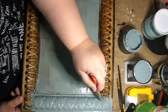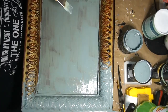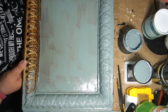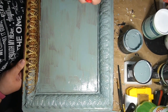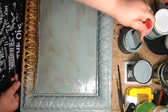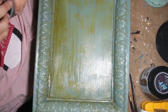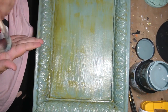I put two coats on this at first, because I thought maybe it was just a slick surface and the paint wasn't sticking to it. But after my two coats, I had the worst bleed-through ever and I could not figure out why. After those two coats, I ended up going over it twice with Big Top, because that is a sealer. It's not the best choice, but look at this — that's coming from the tray. It's like a yellowish, gross, nasty looking bleed. But this is after the two coats of paint and the two coats of top coat.